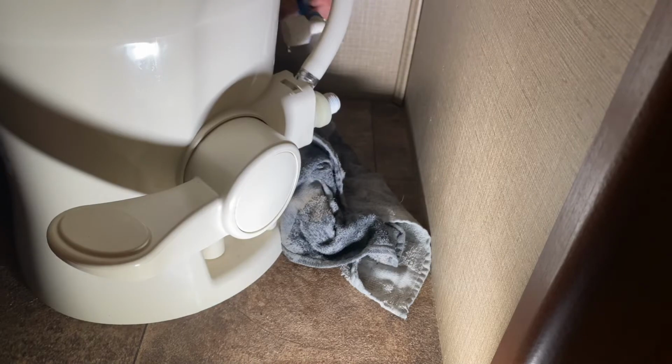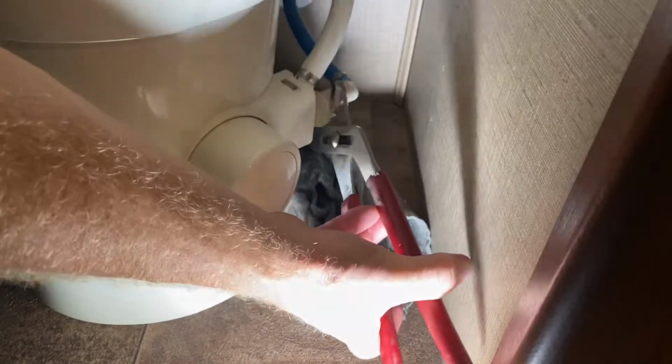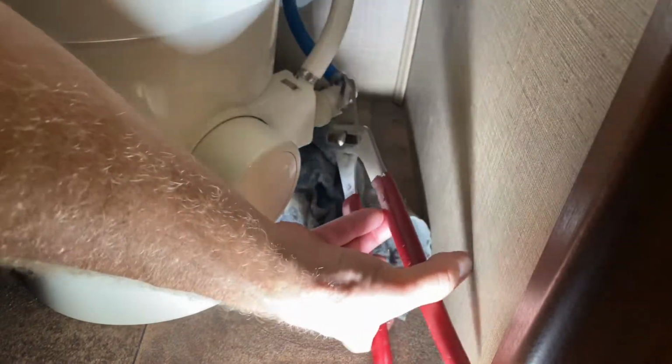So I'll put my towel back down in there, and I'll pull it out from the wall. And again, if this wasn't long enough, I would have added an inline shutoff valve. That would have gave me an extra couple inches, which is all I really needed for this. And I may still do that just as a convenience feature. I'll get it hand tight, make sure it's not cross threaded, and then I'll use my channel locks to snug it up the rest of the way.